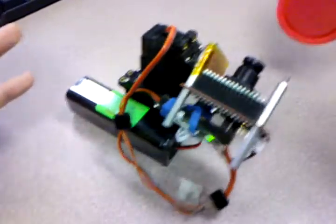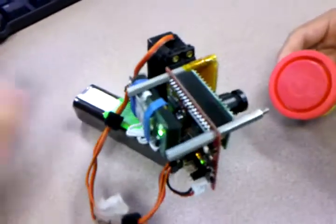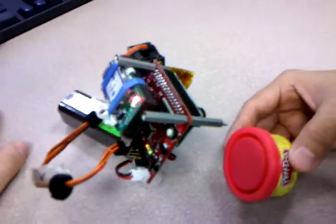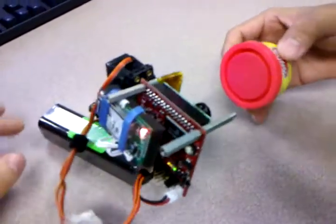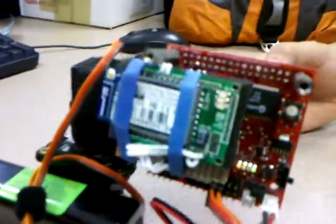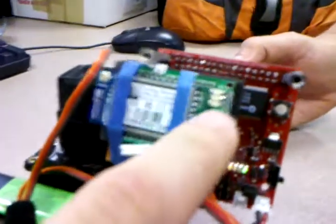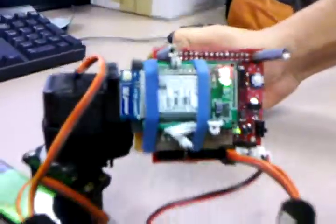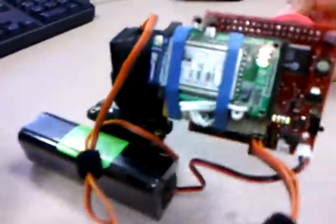The goal is to have a robot that does color tracking wirelessly, controlled through a laptop, with the ability to change parameters on the fly. Right now everything is connected via UART. The Wi-Fi is just pulsing because it's not connected to a network, and the red LED indicates it hasn't secured an IP address yet.